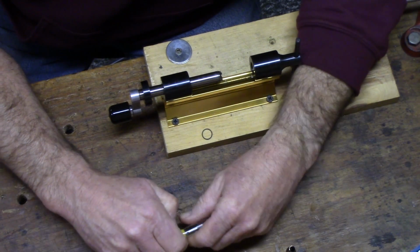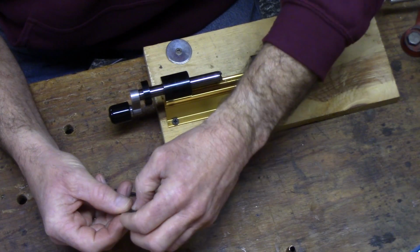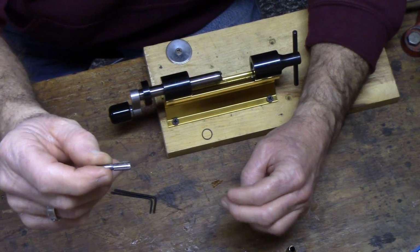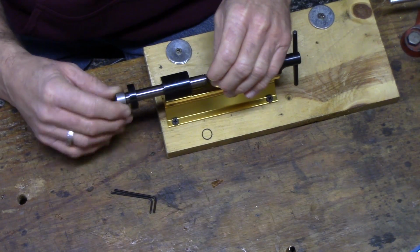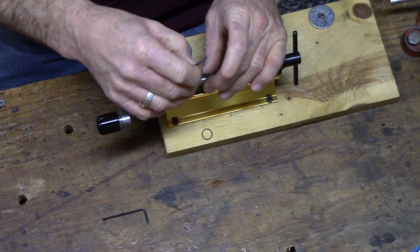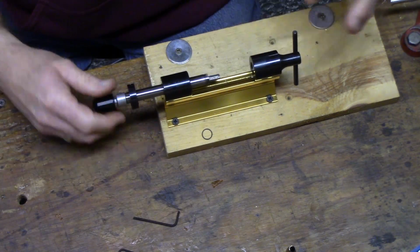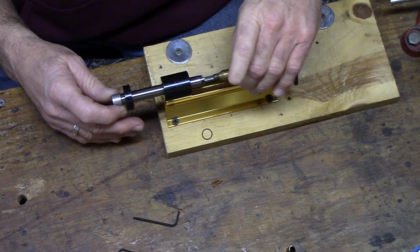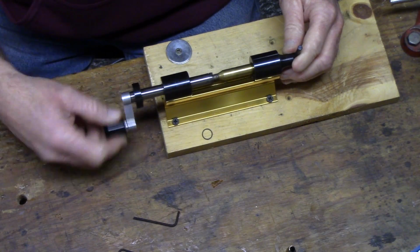What we're going to use is a very little reamer. Like I said, with the neck turning the outside, that unit was about 36, 38 bucks, I think. It's a little bitty reamer, and it is 243, 6mm only. So, 26 bucks for this thing. If you got a lot of different calibers, there's a flat that lines up with the set screw. Lock it in there. This is by far the easiest of the two. Push it into your collet grip, and that's all it takes right there.